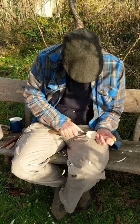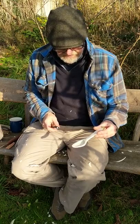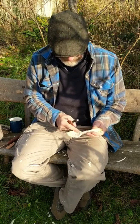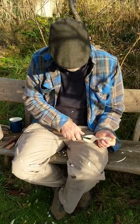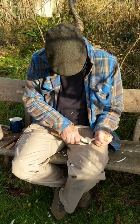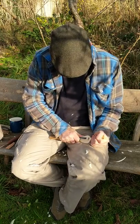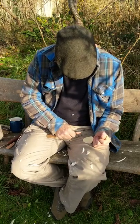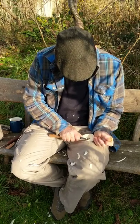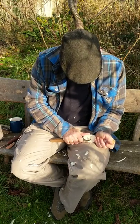I'm working across grain, staying in a little bit from the edges. It's deeper at the back here. With a tangential cleft you're carving down through the growth rings — you might just see little rings in the bowl. I'm twisting the spoon quite a lot as I do this, presenting the workpiece to the knife as well as working the knife through the wood. All these movements come more and more with practice.